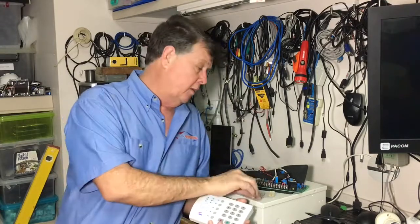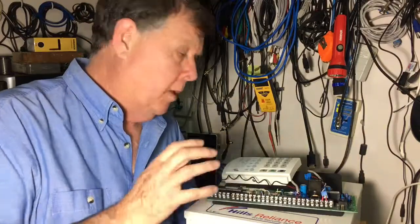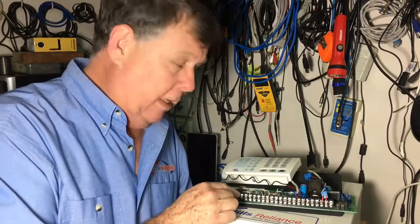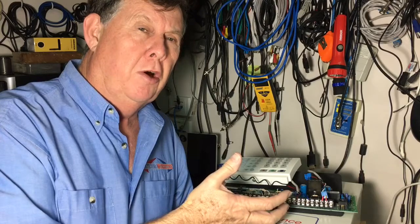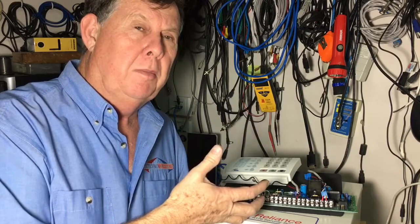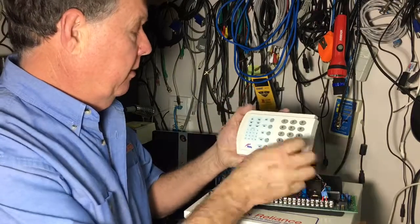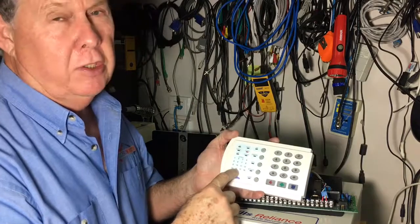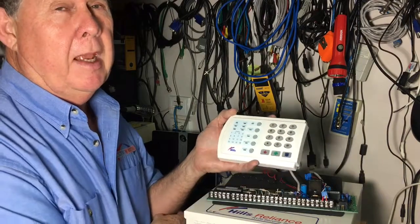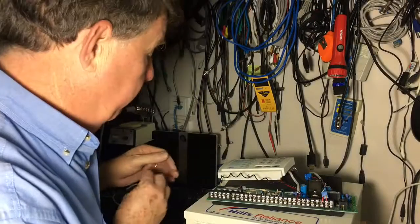So you have to get the resistors right. Let's go through and have a look at how the resistors work. What I've done here is I've taken out my 3.3K resistors from zones 1 and 2 just to free them up, and I've also gone into programming and turned on zone doubling. This is now giving me exactly what I'd expect on the keypad — I've got zones 1 and 2 in alarm and zones 9 to 16 flashing as well, which is what I'd expect with that programming change.